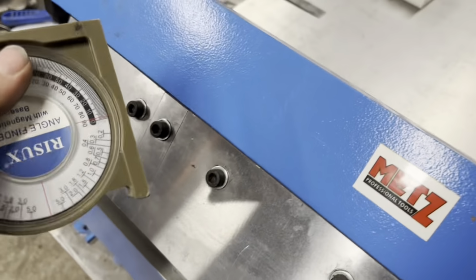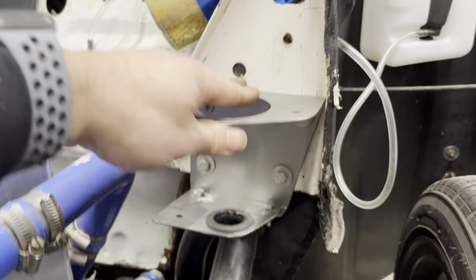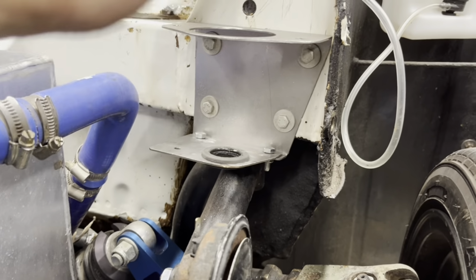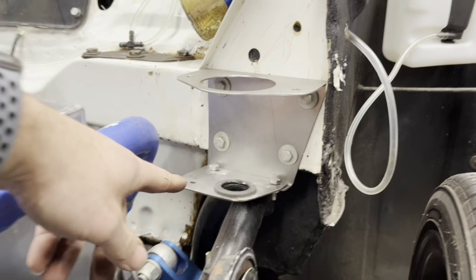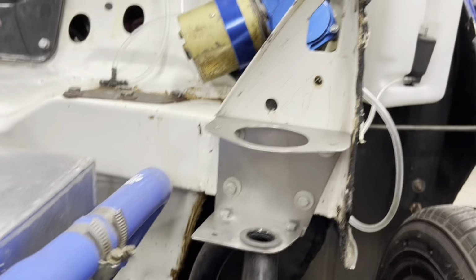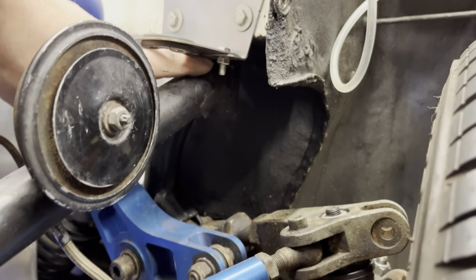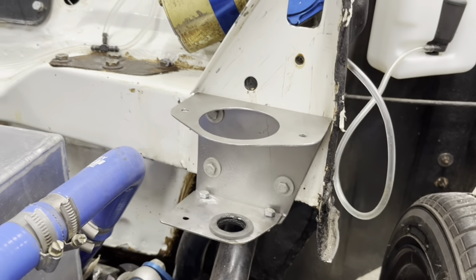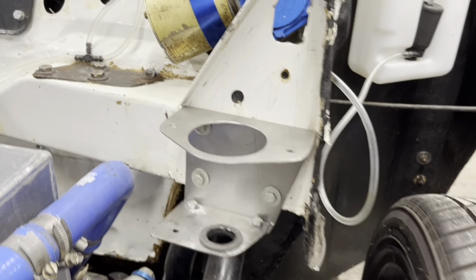Beautiful. Right. Do you know how many times I've dropped this thing on the floor? Surprisingly, it works. So what I've done, I've cleaned all this off and I've put 4 stainless steel long reach rivnuts. Now that ain't gonna move. So just put it in there just to see how it looks and feels. It clears. We've got clearance underneath, so it's not gonna vibrate. What we're gonna do now is just take it off, paint it up, put it back on.